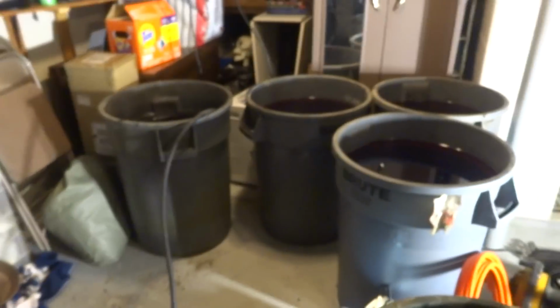Tank's out of the way. I got the new tank in with the legs. Passed by 3/8 90, malleable 90, a 3/8 nipple and a ball valve for now, and I'll put a Firematic after. And I'm filling it. I'm putting the oil into the new tank.